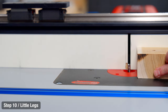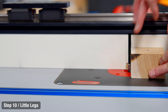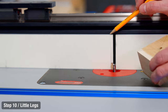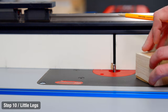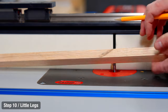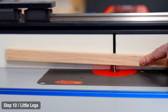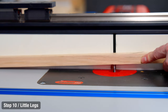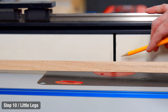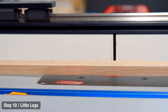If I put a block up against the bit, the two edges meet perfectly. You could also do this with pencil marks, but I'm going to use the edge of my fence. My board has a start point and an end point, so I know I can plunge down, line up those two lines, and then go until those lines hit. I'm going to do this in multiple passes — that will give me my stop groove without any stop blocks.